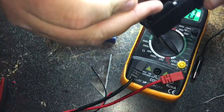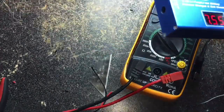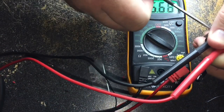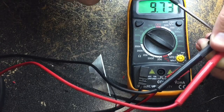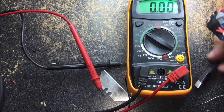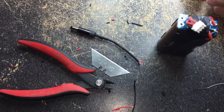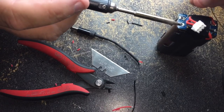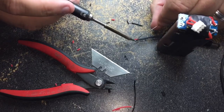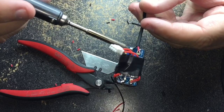Let's test them. Put those two batteries in and - look there - it's coming up as a 2S battery. Those two batteries are not very balanced at all. Take this buck converter - it was set at 16V, so essentially I had two 1S batteries and it was making 16V because of the converter. We turned it down to 9V, which is what we wanted. So now that barrel connector will get connected and wherever those batteries are they will continue to pump out 9V - hopefully this will keep the low power condition from occurring in my RapidFire module.